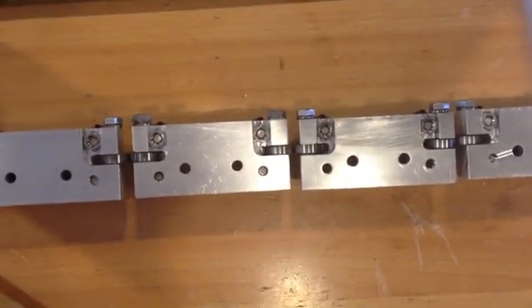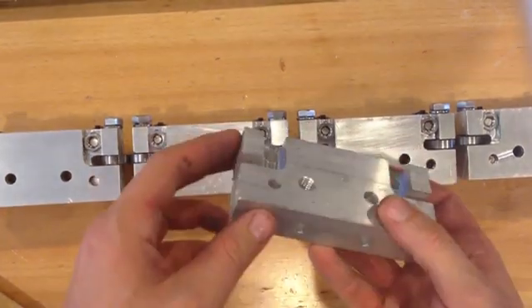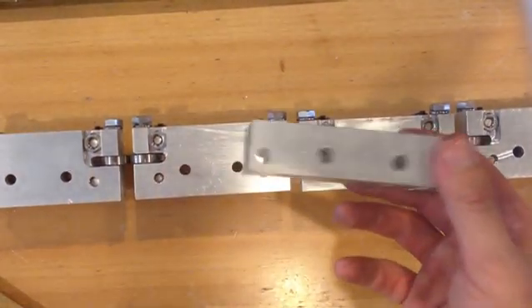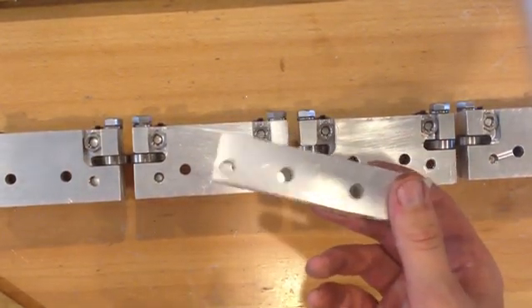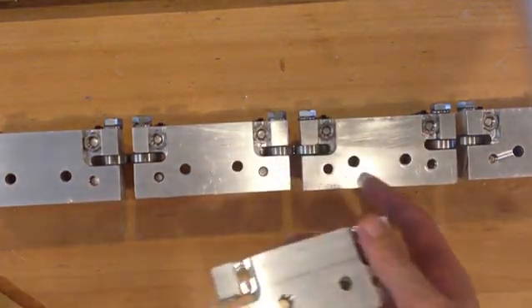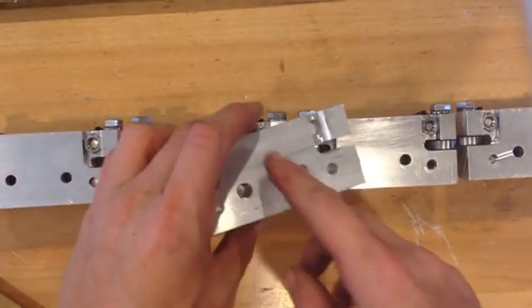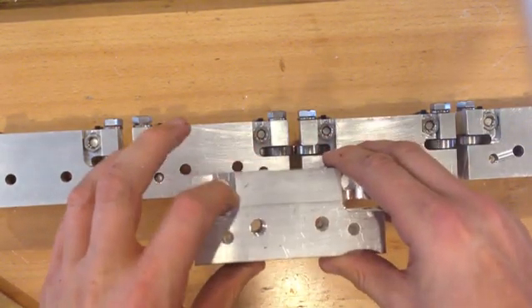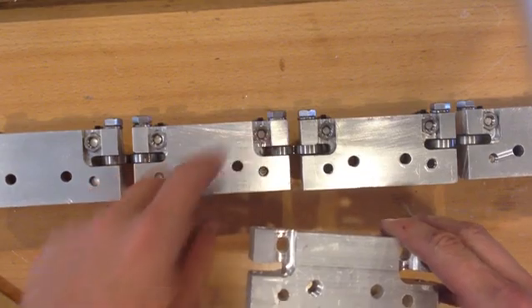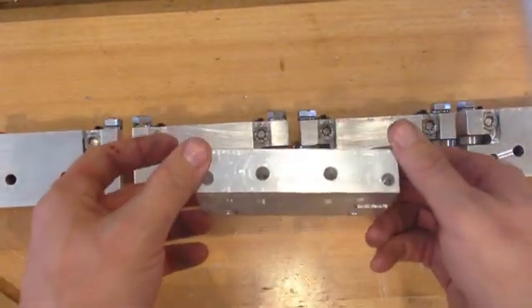It worked pretty well for the first four but it was taking forever. I really didn't have a deep enough bit that could go all the way through. I had to go through half, but even then it was clogging up the two-flute carbide bit I had — it didn't have enough cut clearance. I tried high-speed steel but that had a long reach and that was just horrible. So after doing these four, which came out really well, I decided to just mill out the top part — these two wells, these two slots, and these kind of ovals used for the set-screw bearing. I milled the top side pretty much, but not the side holes.